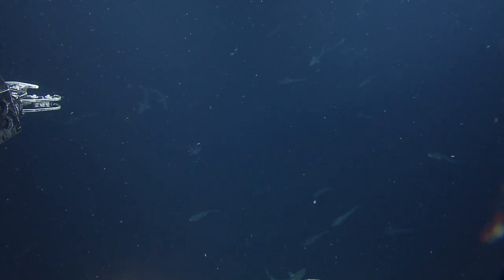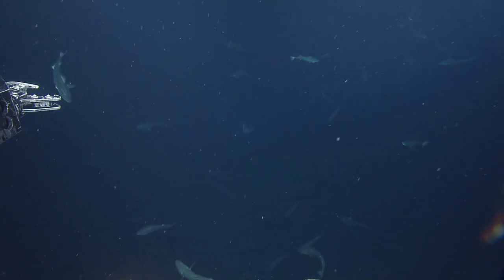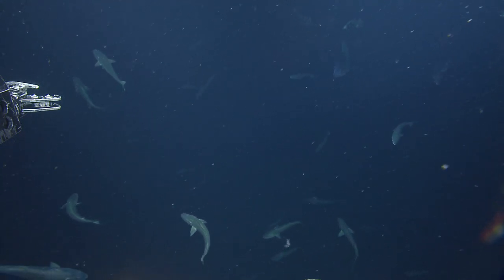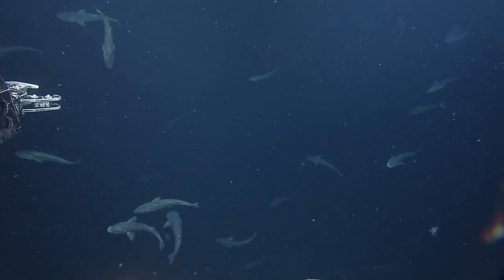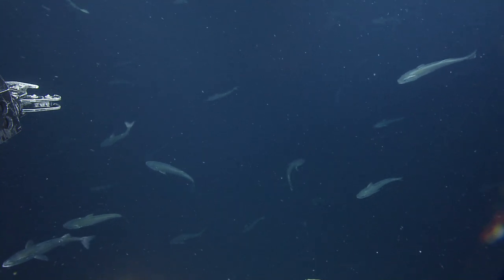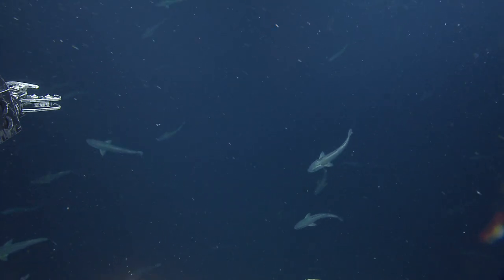Is 40 meters per minute an appropriate speed? How about 20 meters a minute? Let's do 20 meters a minute. Roger, ping out 100 meters at 20 meters per minute. We don't want it to kite in the last bit. It'll find its home better if it comes in slower.